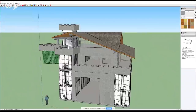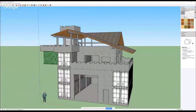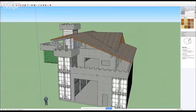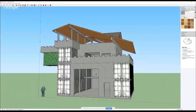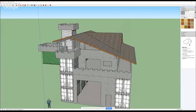On this one, there's not, because look, we got this main load bearing beam here with these columns here, which will continue to here, which then inside has these other columns. So this would be super strong. And the same thing on this wall, this will be the other load bearing wall. Then we'll have the columns there, which line up with the columns on the inside. And there's nothing load bearing in this middle section that's not supported, even though it almost could. I mean, those concrete panels are really strong, but this is a better way.